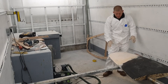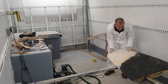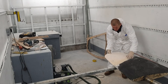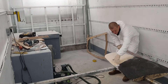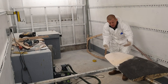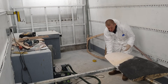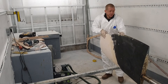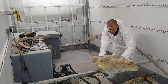So on the edges I've left a little bit too much on purpose because they're easy to board in - it saves filling later on - but we'll let that kick, give it a quick buzz off, board the edges, then we'll see where we are. We shouldn't be far off now. That's had a couple of big fills now and it's somewhere near. There are a few dents and dips we need to sort out, but it's pretty much where we want to be. We don't want to keep putting more filler on this side at the moment because with so much filler in this area as it shrinks, it's actually starting to curl up a little at this end - giving us a little gap here - so we're inclined to keep filling but it doesn't really need it. The right amount is pretty much on there.